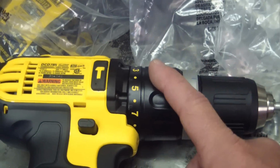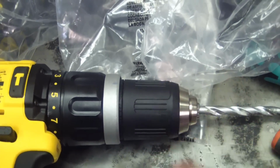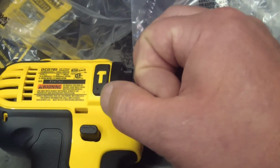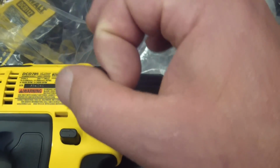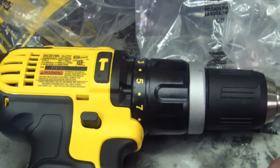Yes, the black and yellow fanboys are going to be all over me, because this is for masonry only. And I was drilling a 6,000-year-old rock. However, if you're drilling concrete, it's got pea gravel aggregate in there. So if you hit one of those stones, you're hooped. It's not going to drill through.